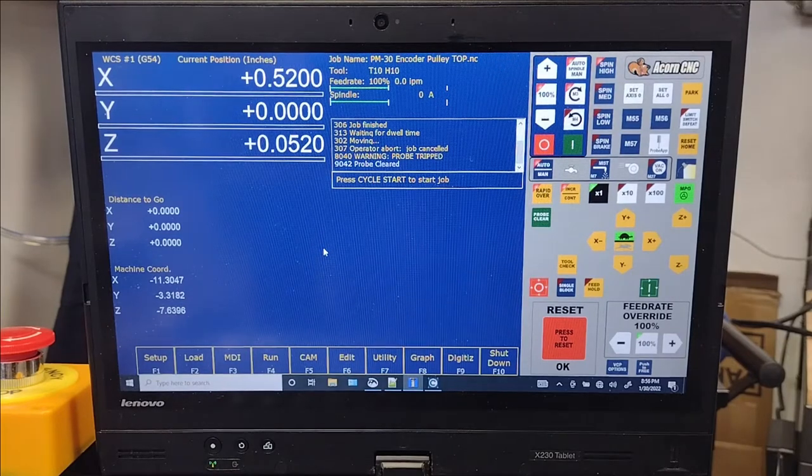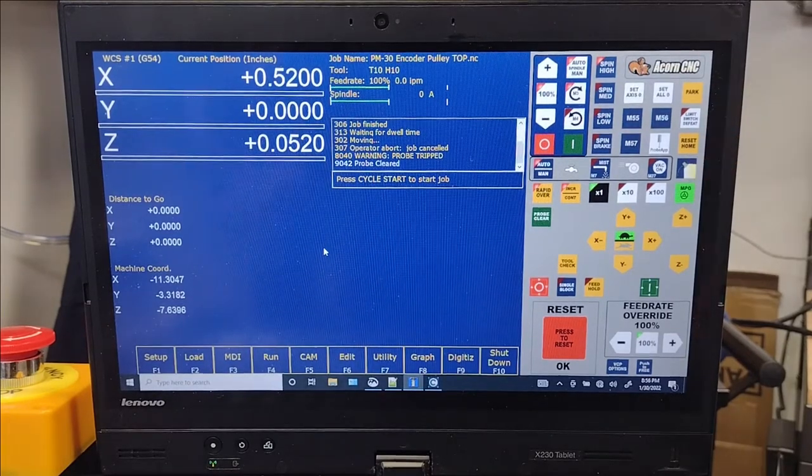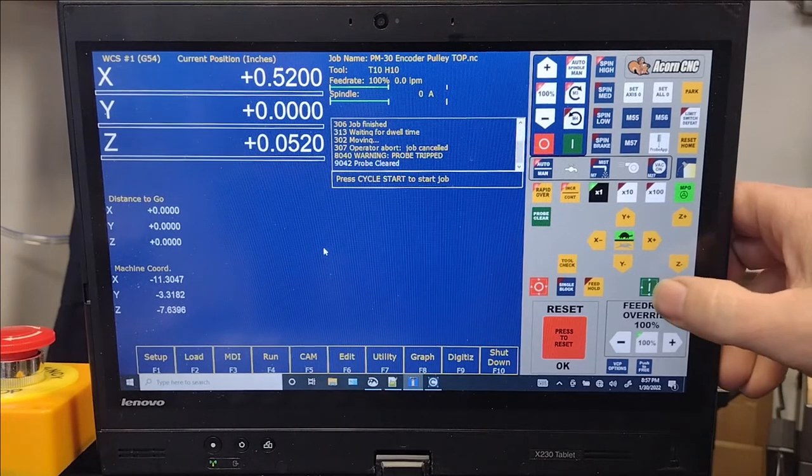Now I do know that one of the cool things about the probe app and the new Fusion 360 post processor that I'm using is, again, it integrates Fusion 360 with this Mill CNC 12 program. So I do know that some of the tools, like this tool that I'll be using, the diameter is not in the library for Mill CNC 12. And I left it that way so you could see how the two integrate and how they handle any mismatches between the two different tool libraries.